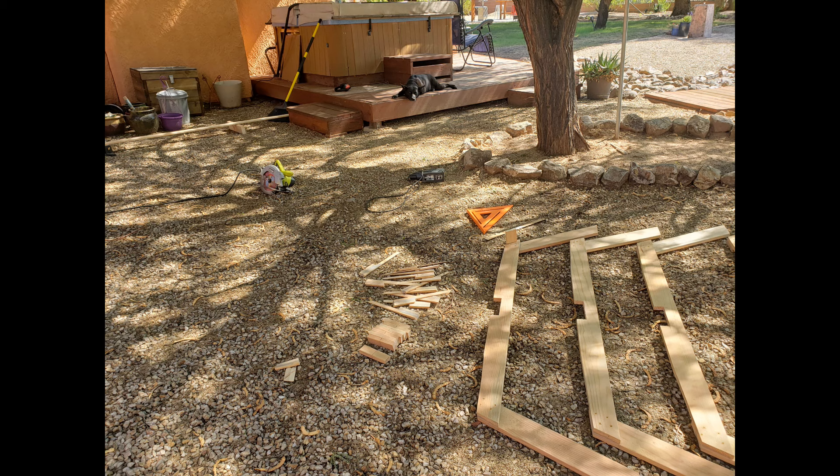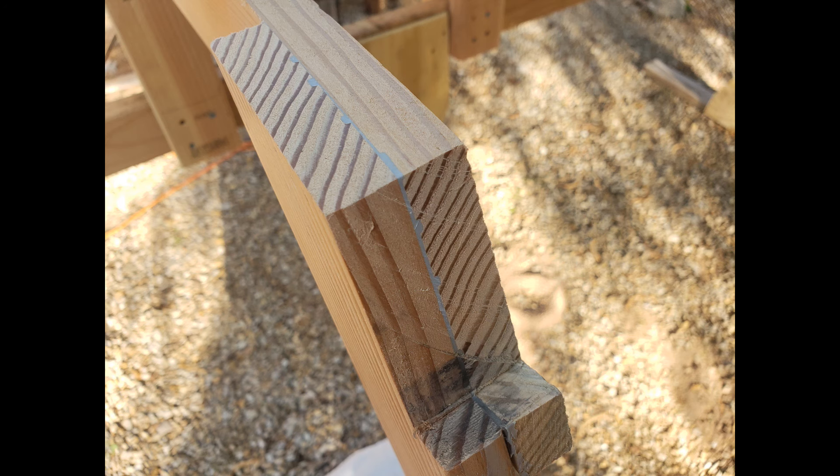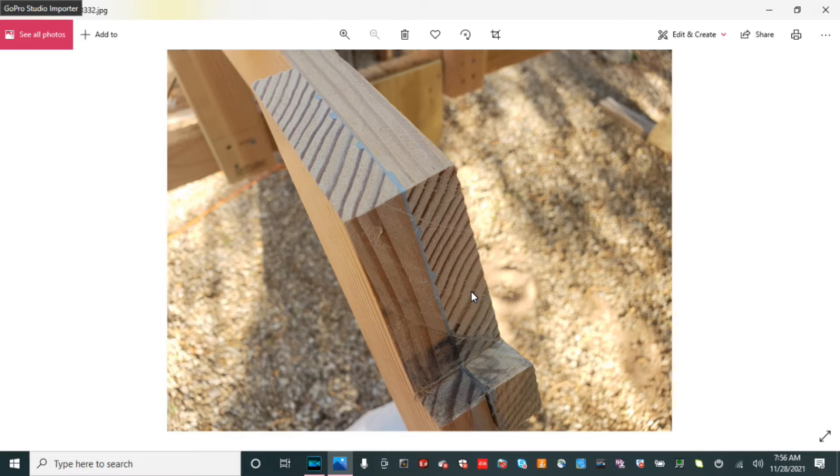I should take the time to introduce you to my assistant, Olive, who faithfully stood by ready to help at any moment during this entire project. Earlier I mentioned that the frame joins would get cleaned up — this shows how notching for the chine and cutting the wedges did just that. You can also see how the adhesive clearly filled the channels that I routed before screwing the frame pieces together; I'm using the cursor arrow to point out small pockets filled with glue.